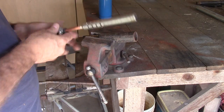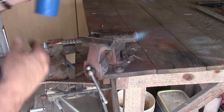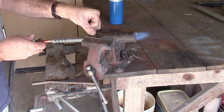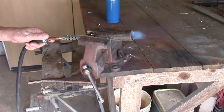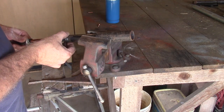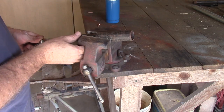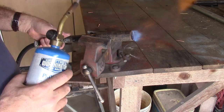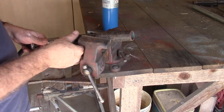Let's put that in there and turn the gas on. This three-quarter-inch pipe position does make a difference. If I pull it too far in, you don't get a stable flame. As you advance it, you'll notice it pops and you do get a stable flame.